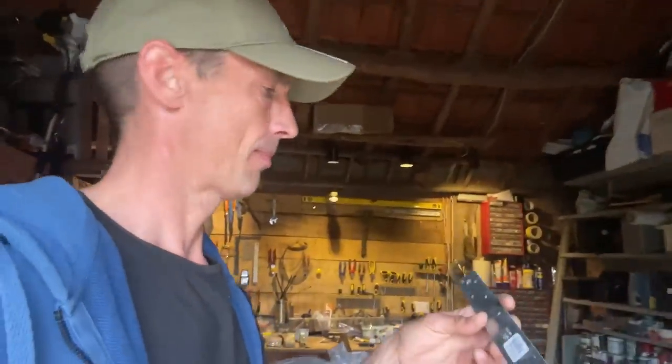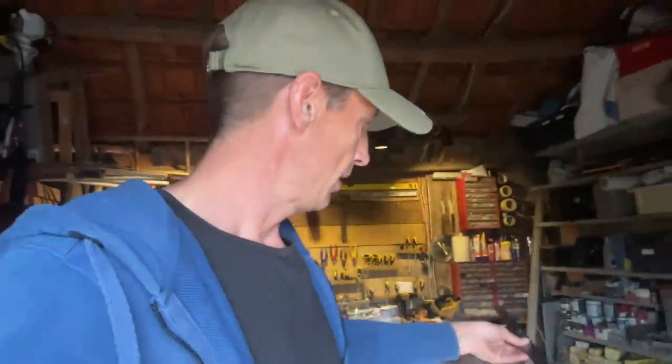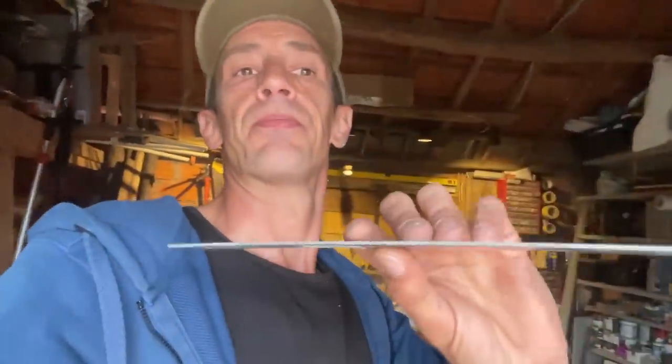Now I bought these 2 years ago and I was looking in every DIY store now, but I couldn't find them. So what I did now is I bought these strips. I bought 7. We need 20, we have 20 rafters on each side. So I'm gonna cut these in 3. Drill some holes in them, 2 screws for both sides, and then we should have nearly the same as this. So that we need to do first before the insulation can go on.